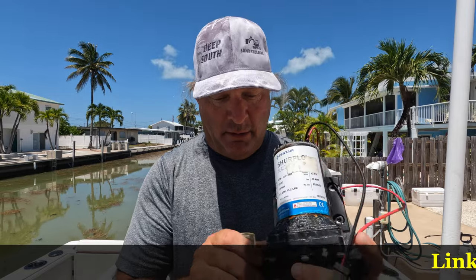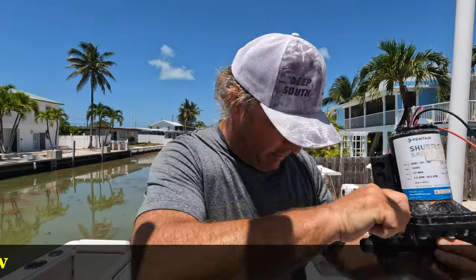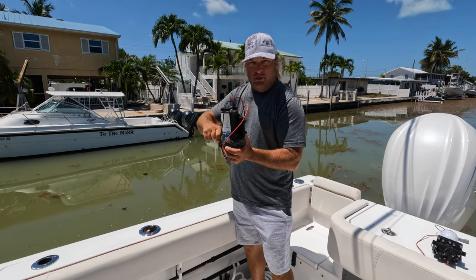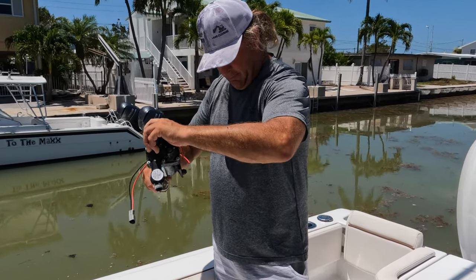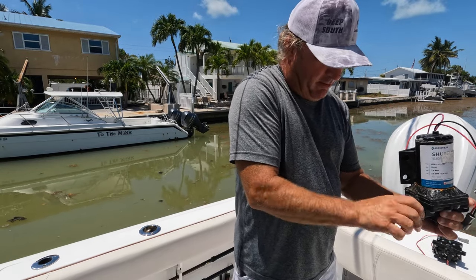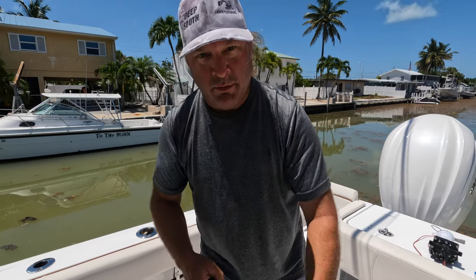Here's your Deutsch connector. This is the intake side — you have this little screen with a clear cap on it. The reason for the clear cap is so you can see inside to check if your pump's not working right when you're out fishing. This one's got water in it — I'll dump it over the side. You can see there's a little screen filter in there and it just screws into the top piece. It's hand-tightened, though it does have a couple of grooves where you can grab it with channel locks to make the final adjustment.